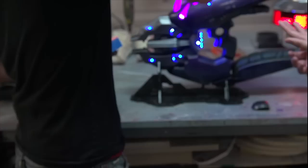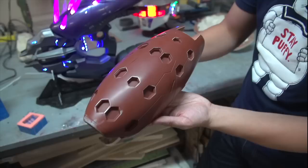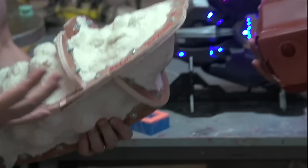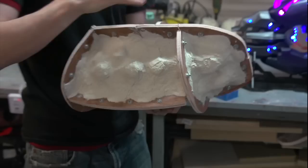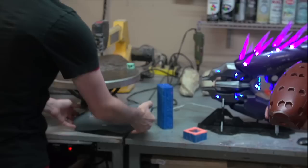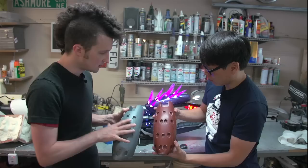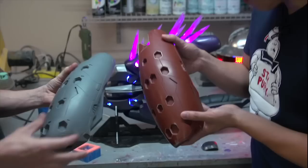For the bigger part, this is what the mold looks like — silicone rubber on the inside, with a mold jacket on the outside to keep the silicone in shape. You dump the two-part resin in and slush it around; as it cures it sticks to the sides and you end up with a hollow, lightweight part like this one. This was my first pull from the molds. It's very solid and probably about half the weight of the prototype, maybe less. Since it's all one material, it's not affected by heat or moisture — much more durable. Whereas Bondo will scuff if you press your fingernail in, this urethane resin is very rigid and won't be going anywhere.